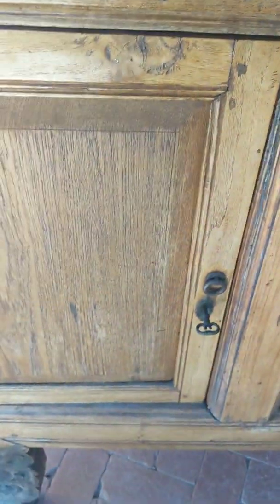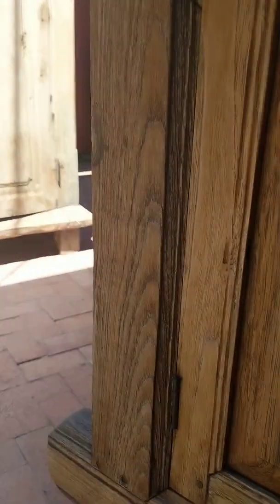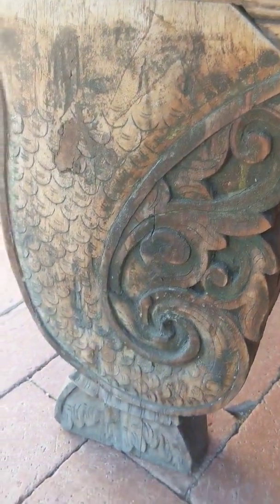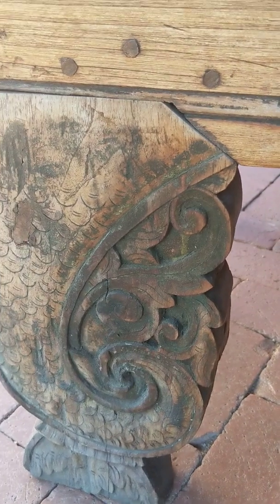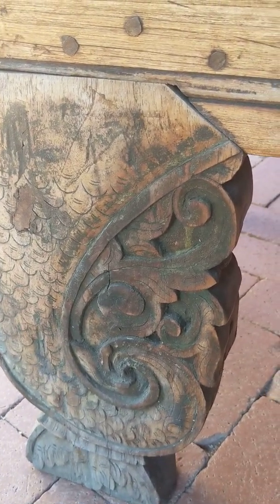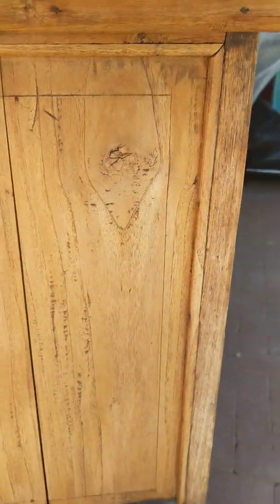The front of course is in better condition but it's still rough. The construction here is really nice — it's all done with doweling, and you can see the hinging here. There's still stuff in here; I haven't cleaned it out yet. So structurally it's in decent condition with some really nice detail. I'm going to give everything a good sanding on top where I can. Of course here I can't sand because I'll risk damaging the detail, so it will get washed very well and I'll probably hit it with a little bit of steel wool.